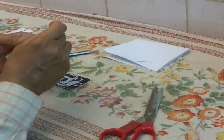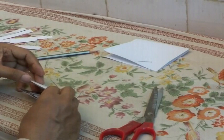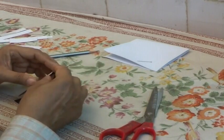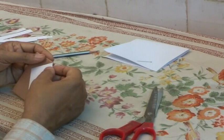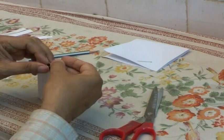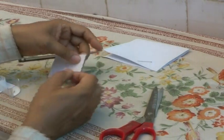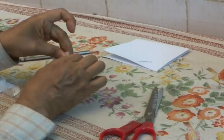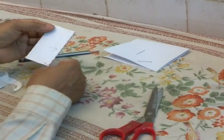After cutting the prints to size, we pass two paper pins through the diagonally opposite corners of one of the prints from the non-printed side. Using these diagonally placed pins, we align this print with any two diagonal holes drilled earlier on the copper clad sheet. Now place the other print face down onto the copper clad sheet, aligning it using two of the diagonal holes and keeping both pencil arrows vertical. This portion of the video runs unedited as this is the most crucial portion. Once two of the diagonals are aligned, you will find that the top and bottom layers are beautifully aligned. We then stick the edges using 3M tape on all four sides so that the top and bottom paper layers are fixed to each other. The alignment pins can now be removed and we are ready to transfer the toner.